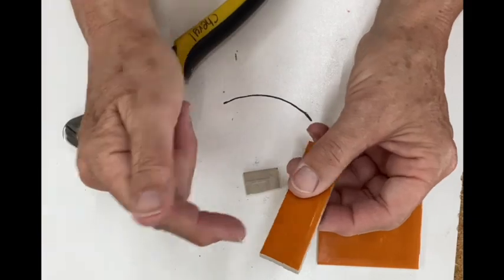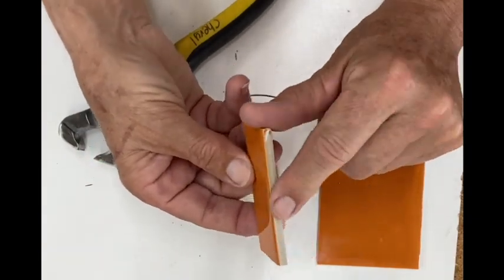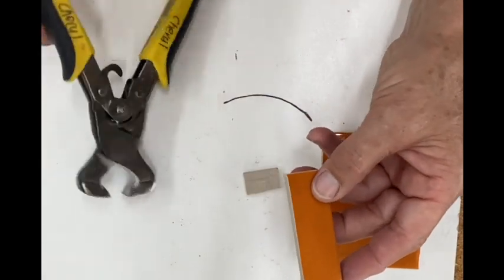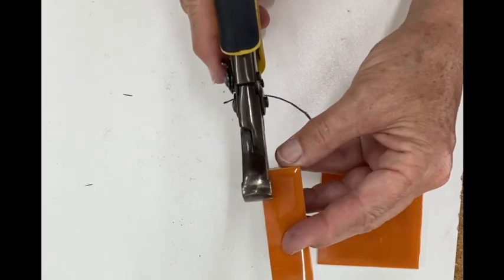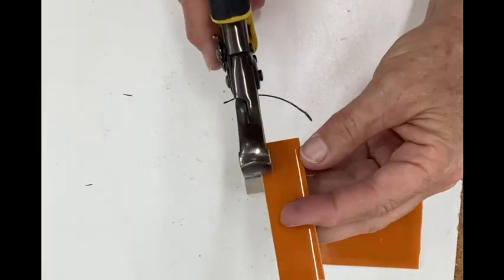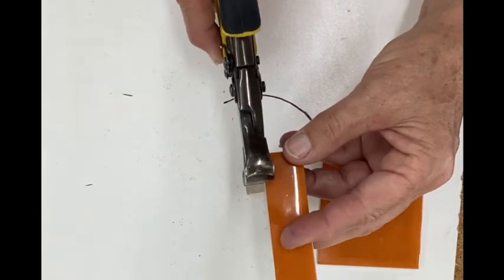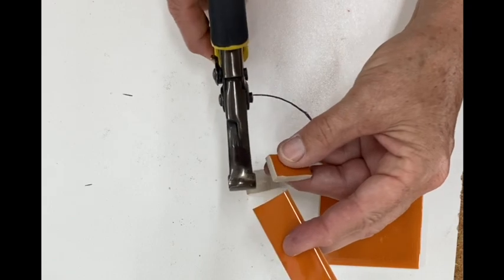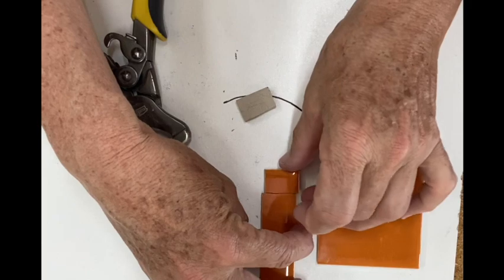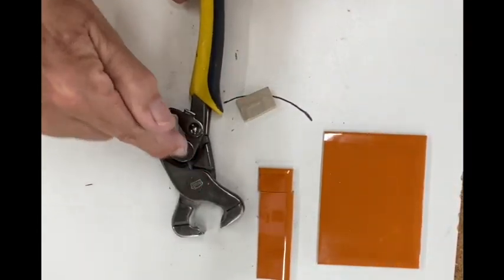Now the other thing I'm going to do, instead of cutting it on the glazed edge, which is the smooth edge, I'm going to cut it on the raw side, and that will make it easier to cut again. Just slide it in halfway. You don't need to have to get a straight cut all the way over, just halfway, hold it and snap. Beautiful straight cut, nice and easy. There was no exertion on that because of the double mechanism.